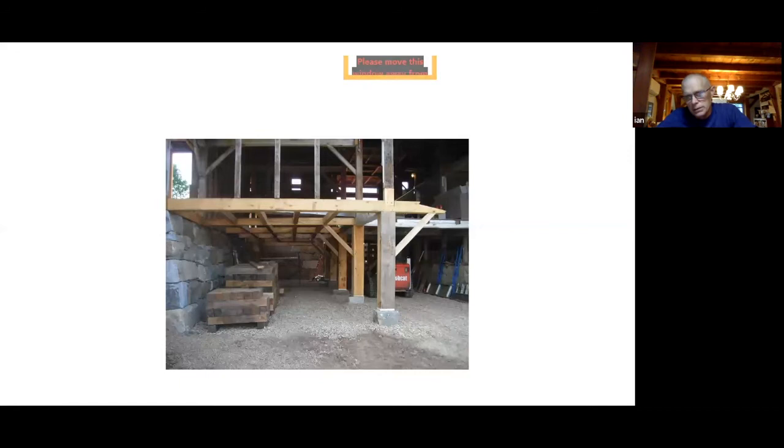Now let's talk about timber frame repair. This barn has some timber frame repair and a whole new floor going in on the left-hand side — that side had a rotten floor and an open haymow. This was run by a school that wanted to run events there, so we were adding a timber floor on that open haymow side. On the right-hand side you can see what we call a locking lap joint to accept a new timber. In ground level barns, you're often going to find rot at the bottom of the posts and the sills, requiring timber repairs.